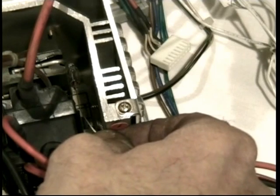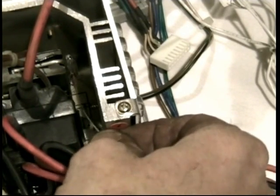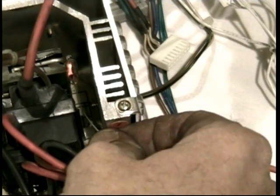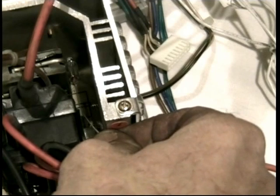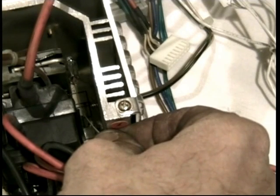When you have a problem with X-ray protection, what will happen is this. It'll just flash once. You hold the neon bulb up against the core with the monitor turned off. Then you turn the monitor on and watch the lamp. Okay, it came on and stayed on, right? So I know that I have high voltage, my horizontal is good, all that stuff is good. And I've got to kind of simulate this. When you have an X-ray protection problem, where it's gone into X-ray protection due to what failing? What section? Power supply failure, right? Going too high in voltage, right?